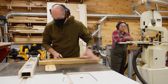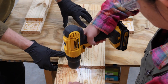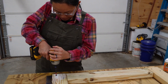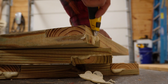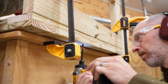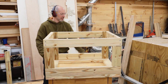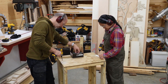To assemble the three frames that make up the majority of the planter box structure, we wet one side of the half lap joint and then spread Gorilla Glue on the mating piece. After checking for square, I drove in a few screws. This glue reacts with the wetness of the other board and creates an expanding foam bond. Excess is easily cut off with a utility knife. We drive three-inch screws up through the bottom frame to hold the two side frames in place, and then install the two top spacer pieces on the short sides. With the frame complete, we cut half-inch pressure treated plywood to size and attach it with short exterior screws.